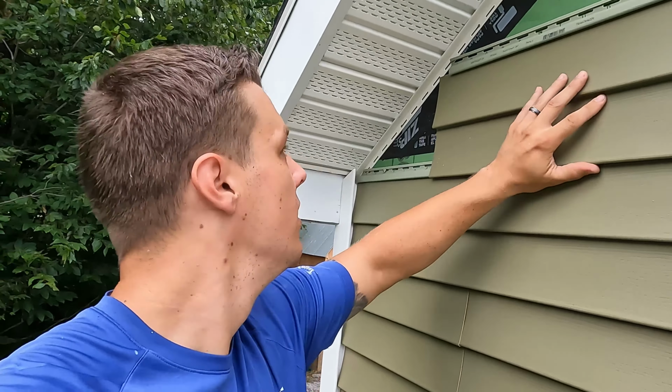Right now, on the bottom, there's a generator hook up here, so I'm gonna basically cut these pieces back while they're still attached to the house for the breaker board. So, you know, take your width of your trim, and then add that with your space of your J channel and then your gap, and that's how far we're gonna cut back now.